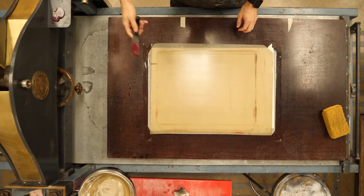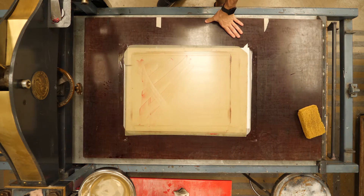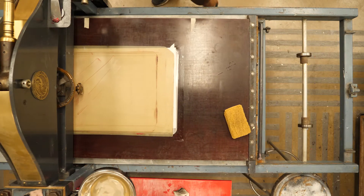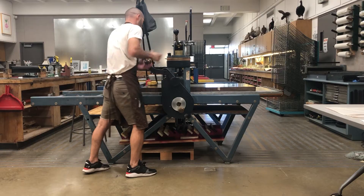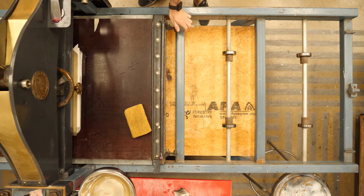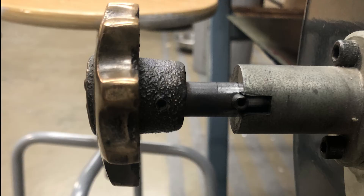For the first proof I'm using four sheets of newsprint to simulate the thickness of our printing paper. If your tympan does not have grease on it, you need to put a little bit of grease on the front edge and drag it across. Bring the plate up to that first mark, pull the pressure down, crank it forward up to the second tape mark, stop, release the pressure, then release the bed. You can see it's disengaged because the notches are not in the groove anymore, and you can pull the bed back.